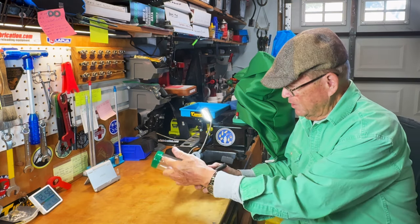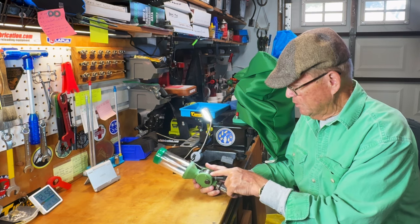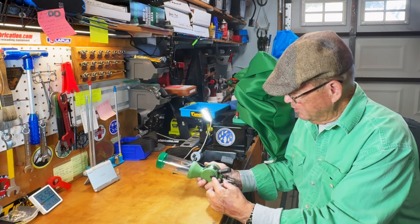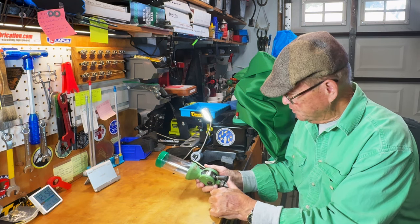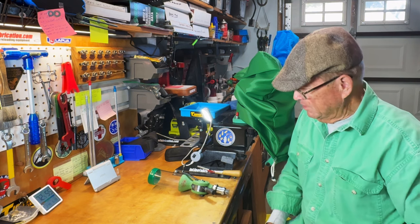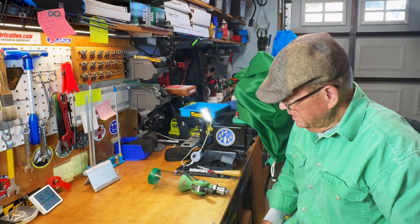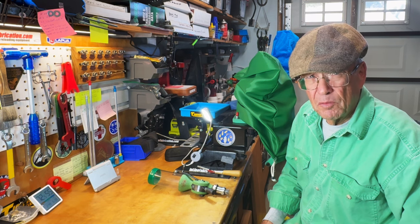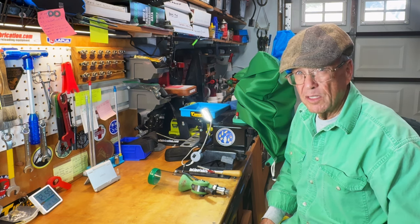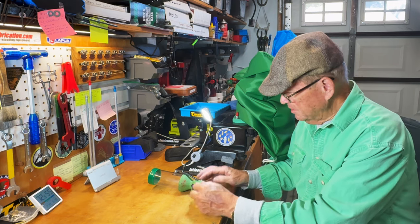Anyway, there was this Redding. It didn't come to me exactly like this — for one thing it had no hopper, it had the large metering chamber, and it had a little bit of surface rust on the cylinder. It was dirty as all heck. So I cleaned it up and polished the cylinder a bit. I looked at the original metering chamber — it was the rifle size, the great big one. I tried weighing small pistol caliber charges, five grains, seven and a half grains of Unique, and it just wouldn't work for those kinds of charges.